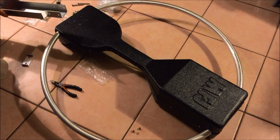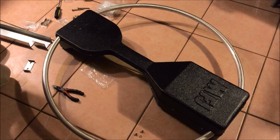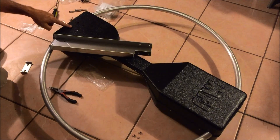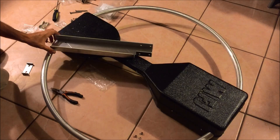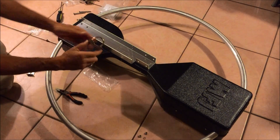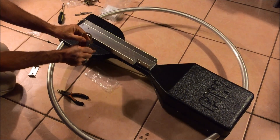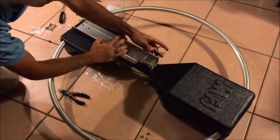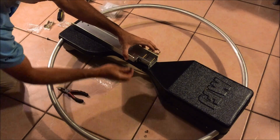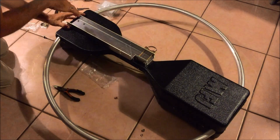The manual is a little vague on installing this, so I'll give you a brief idea. It can be mounted horizontally or vertically. If mounting horizontally, you take the four screws out of the bottom, put the plate on, and screw those four screws back in. Then use the U-bolt with one of the plates to grab onto the mast — use the plate on the back with the nuts and lock washers. You can use a one- to one-and-a-half-inch mast mounted horizontally.